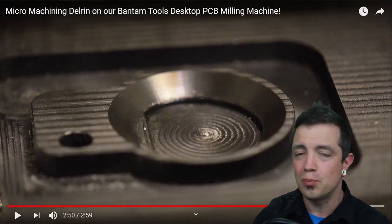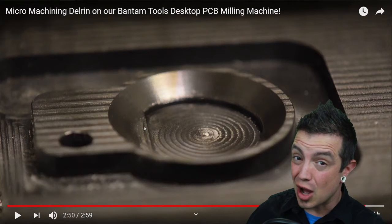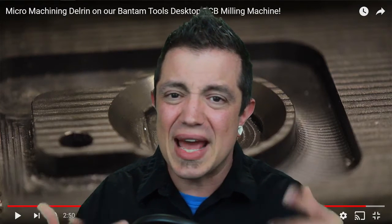There's no polishing, sanding, scraping, or deburring. When I was still on the shop floor, there were a lot of secondary processes created when I ran UHMW and Delrin parts because of all the fraying and frayed edges. So the investment in material-specific end mills — even just to finish, if you have some bulk uncoated tooling to do the main roughing, and then get the material-specific tool to finish — that's always an option. You can focus on that one or two tools to get these superb finishes.